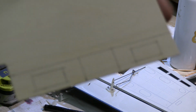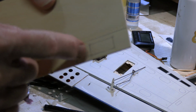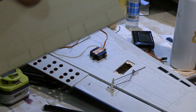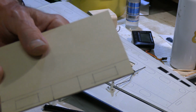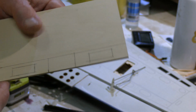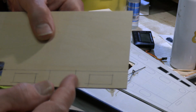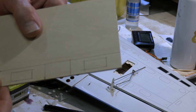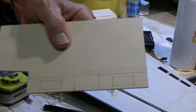And the purpose of that is that I'm going to drill a hole into the middle part, and then I'll use the jigsaw to cut out the hole. And with it all being attached to the sheet while I'm doing that, that'll give me something to hold on to. Then after these holes are finished, then I'll cut them both out. And since I don't know precisely what the width of the saw is going to be between the two, I've got them set up on opposite ends of this little part of the sheet. And that way, whatever the saw cut width is won't make any difference.